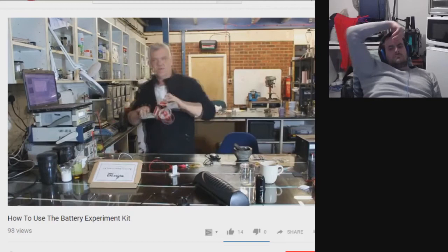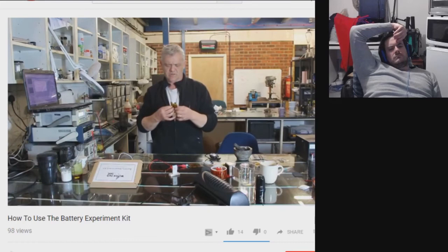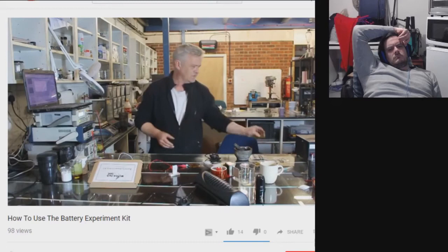We had a bit of Kapton tape there on a tape dispenser, and I can just pull up a little Kapton tape, and then I can take my battery and wrap the tape around the battery to make a Kapton encapsulated cell. This one is actually zinc vanadium. So this is a zinc vanadium battery where I've laid it on top of each other, wrapped it in Kapton, left an opening there, and I can put the electrolyte in there to make that cell. So there's lots of different ways that you can encapsulate, and lots of different ways that you can record your data and provide a load.